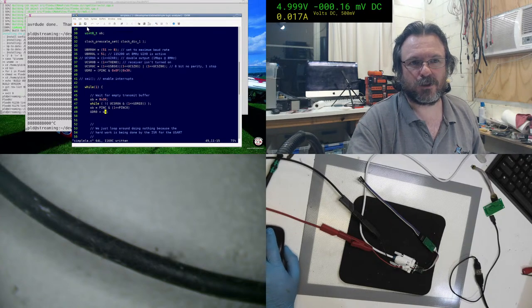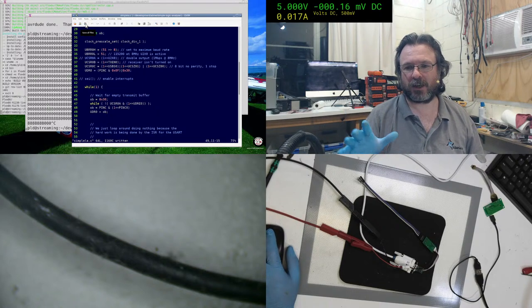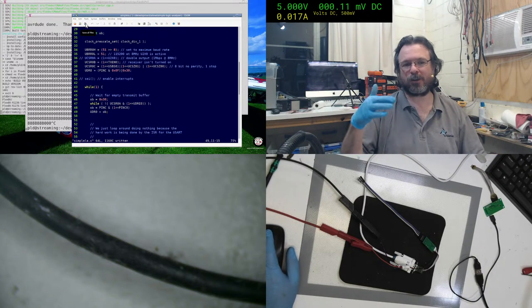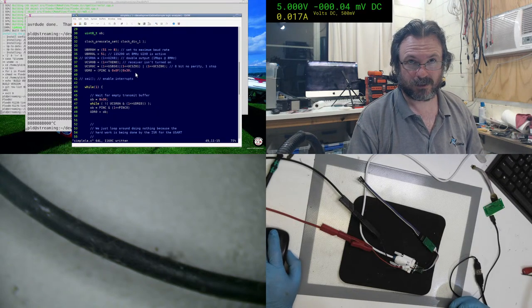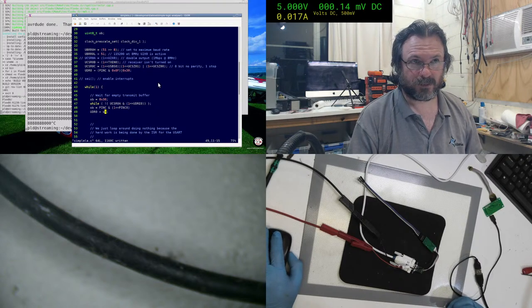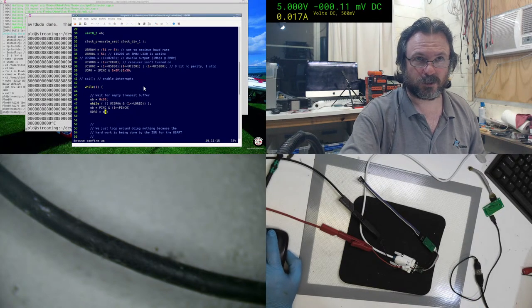Bob, yeah, I mean, you can do that, but there's no need to because we don't really care when the pin state changes because we're just simply taking a snapshot every time. We're synchronizing with when the serial port is ready to send. That's basically what it is. We're synchronizing with the serial port, not with the pin changes. By the way, 3X, that's for an earlier model chip. It's not for this one.